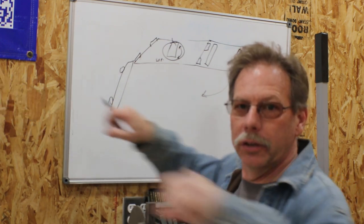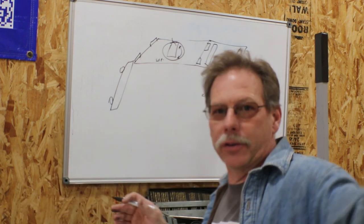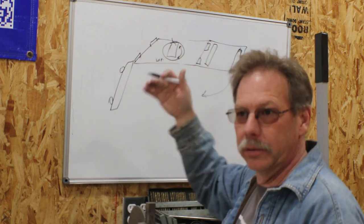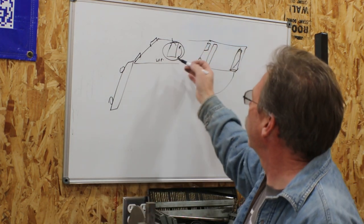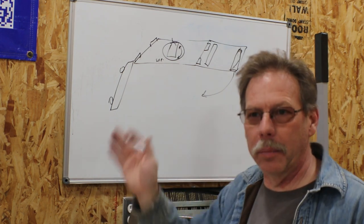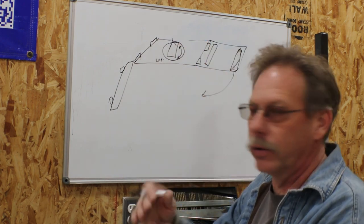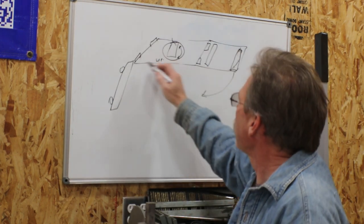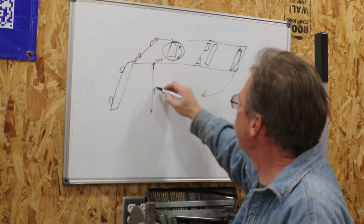The reason for rotation is that I don't want to set my steel on the table and then have to try and swing the steel. Especially when you're working on a 20-foot stick and you're trying to cut two feet off one end - you'd be swinging 18 feet of steel to cut a 45-degree angle. So I want to be able to pivot the saw and leave the steel in place, so you can do cuts from all directions. The rotating part doesn't have to index like a miter saw - we'll let the saw's fence do the indexing.